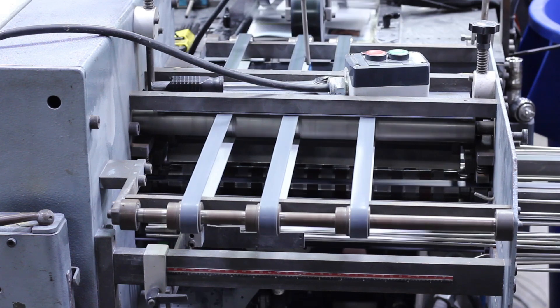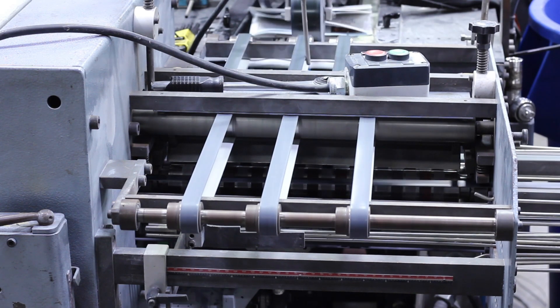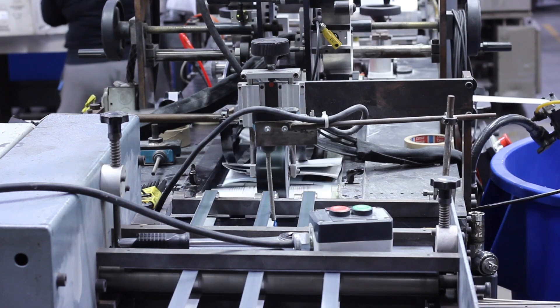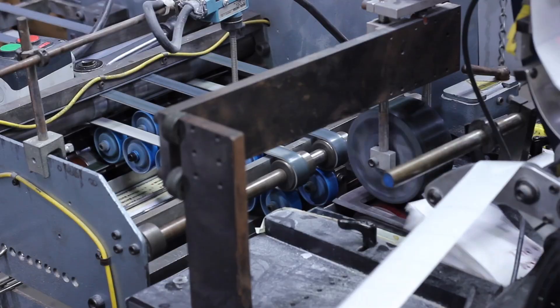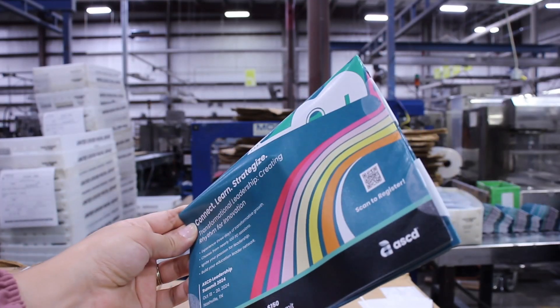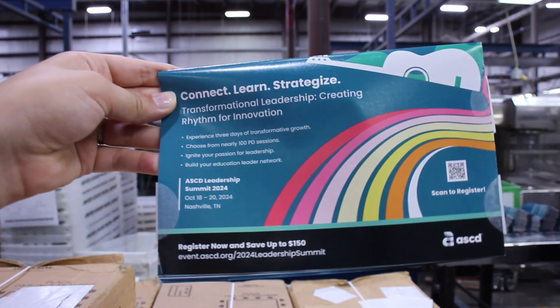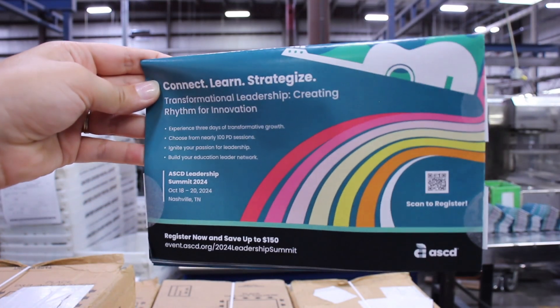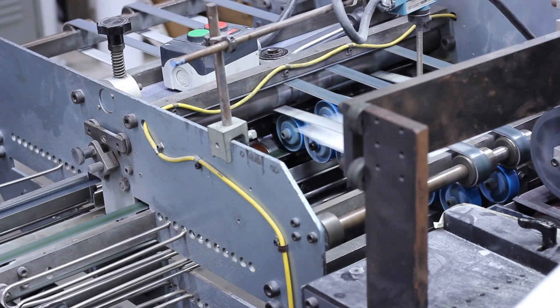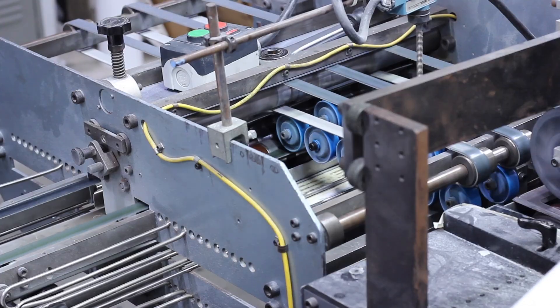The main reasons for using a soft folder are for mailing purposes and size constraints. When used for mailing, you take a standard size magazine traditionally used for regular mail and turn it into letter mail. Letter mail can save our customers money. All soft folded pieces with wire in a book must have two tabs toward the indicia side and one tab on the opposite side for postal regulations. The postal service must have tabs on the books to run products back through their machines.